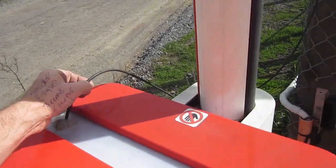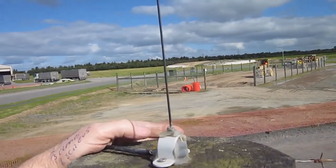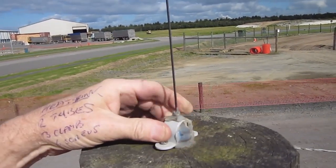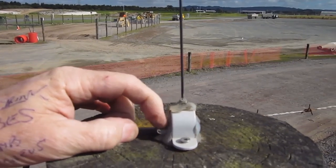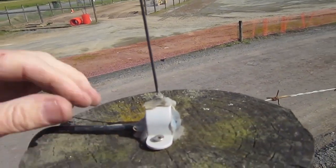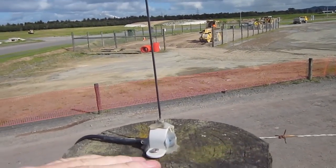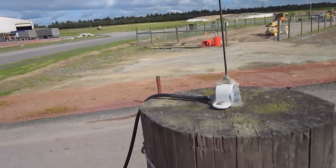What's actually happened is they've decided to mount this antenna up on the top of a pole. Going up to have a look — it's difficult to tell because it's all thoroughly snotted up with silicon, but I would suspect that antenna was designed to come through below a metallic plate. On the top of a wooden pole like this we have neither a reflective surface nor a conductive surface, so this antenna will be probably fairly poor.